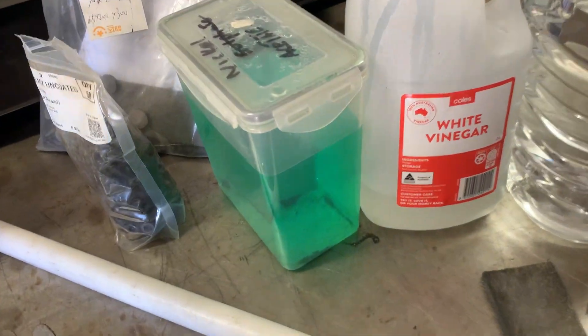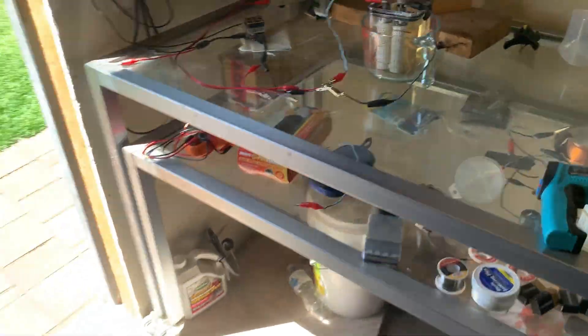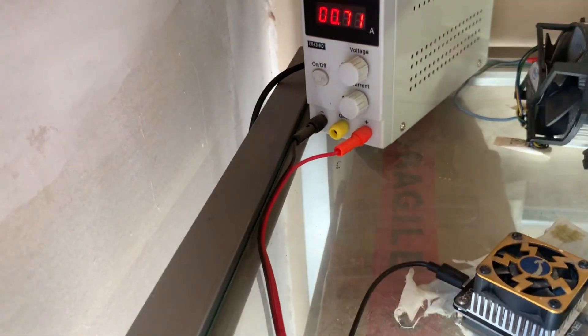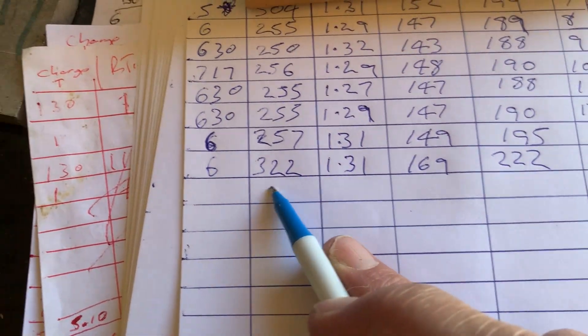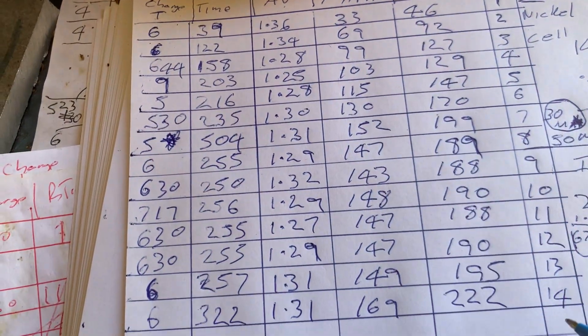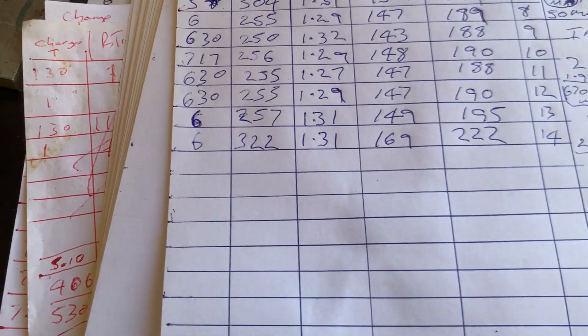So I hope that helps everybody with how to construct their nickel iron cells. Here she is. My power supply over here — I've got it on two volts today and it's drawing 700 milliamps, so we're using 700 milliamps at 2.2 volts. Yesterday's run was 3 hours and 22 minutes, 222 milliwatt hours and 169 milliamp hours, and we're only at 14 charges now. It starts to improve after about 20 charges — it's like the forming charge of the cell.